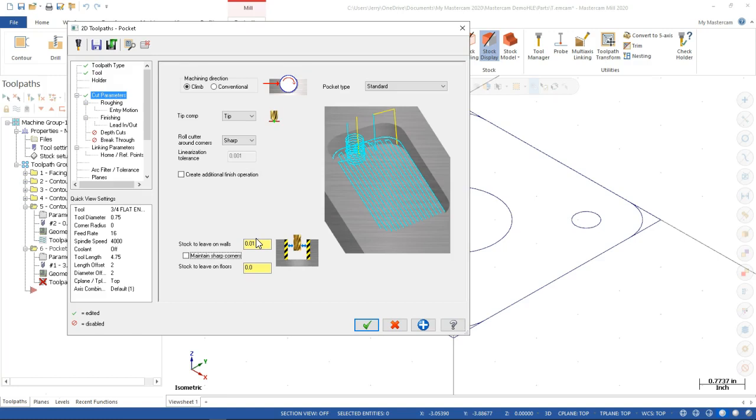maybe I need something to be a slip fit in there, and I want to creep up on that wall slowly, so I'm going to stop the program and pick up that operation again. Then I definitely want it to be a separate operation, because this is going to be continuous. It's going to go right from the roughing, go find the wall, make the finish pass, and I don't want to run through the entire pocket again to hold that tight tolerance. If I don't, we have the 2-inch plus or minus 5, I'm probably going to be there.